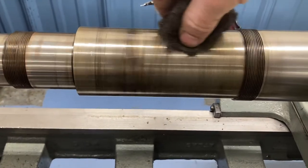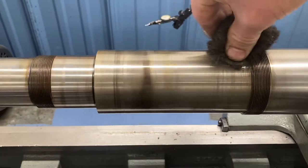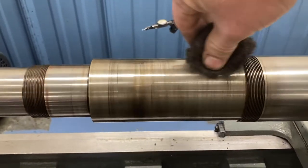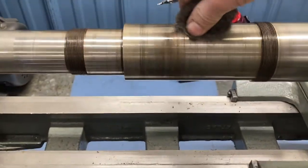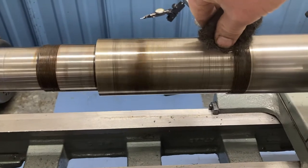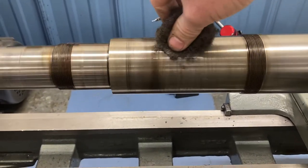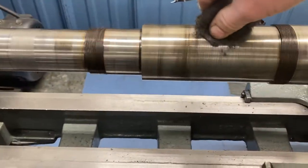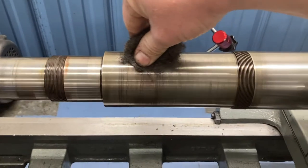I'm just pushing down with light pressure, and if something does grab the steel wool it's not gonna suck me in - it's just gonna kick it off where those key seats are. Sometimes if I was polishing with an emery cloth - which I wouldn't do on a spindle anyway - but if I was gonna polish with something more abrasive, I'd probably lay down a couple of shop towels on the ways just to keep that abrasive stuff from going in there.